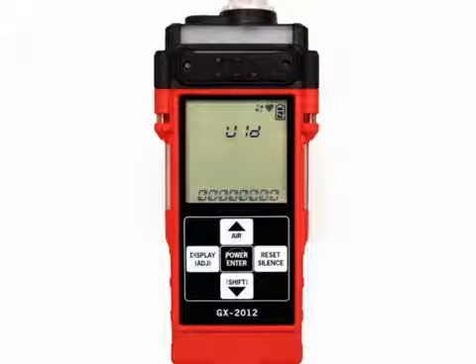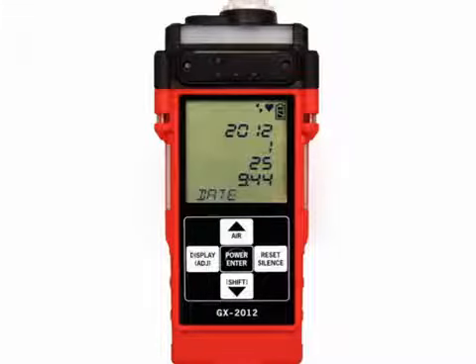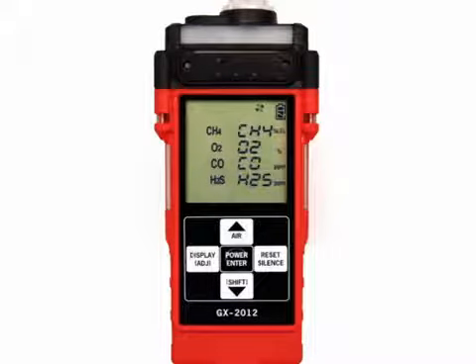If the ID display setting in maintenance mode is on, the user ID screen will appear for a few seconds, followed by the station ID screen. Once the normal startup sequence begins, the first screen is the date and time screen, which appears for a few seconds. Next, the battery voltage and alarm pattern screen is displayed, showing the current battery voltage and the alarm logic. A D appearing before the V indicates alkaline batteries are used.